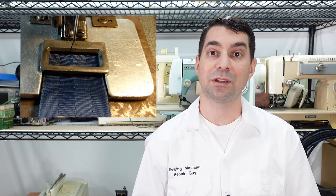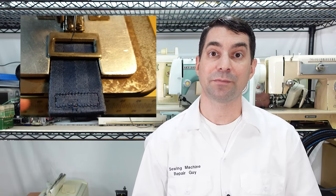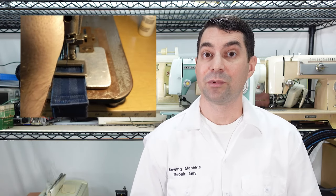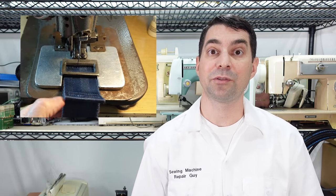A bar tack machine moved the fabric around, and this was seatbelt material, and it was trying to move that material while the needle was inside the material. And when I was able to time that correctly, those machines worked much better, and that factory was put back into full production capacity.